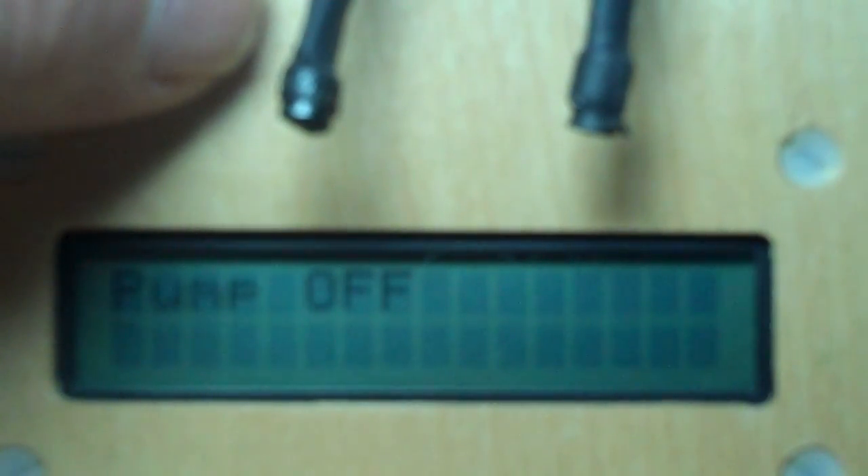We're going to press the increment button and decide whether we want the pump to be on, off, or automatic. It's on automatic. We can change that — turn the pump off, or turn the pump on automatic. The normal position for the pump would be on automatic; this is when we're collecting heat from the collector.